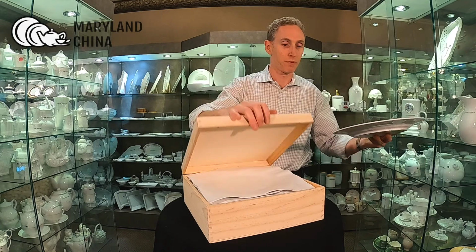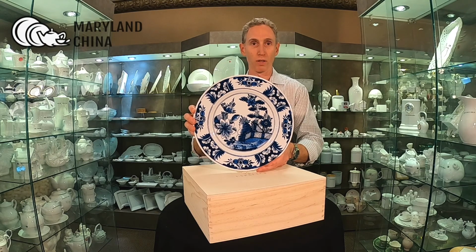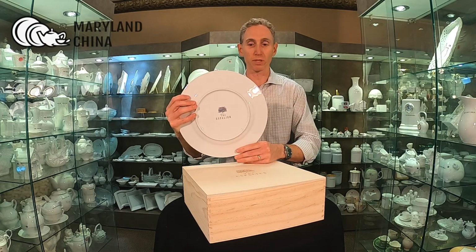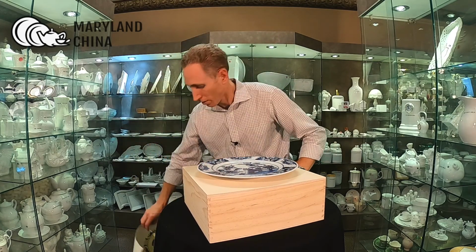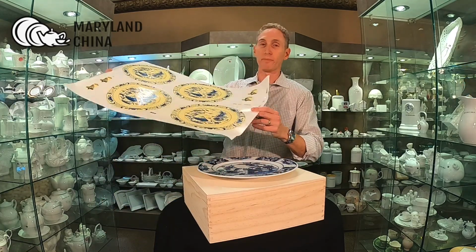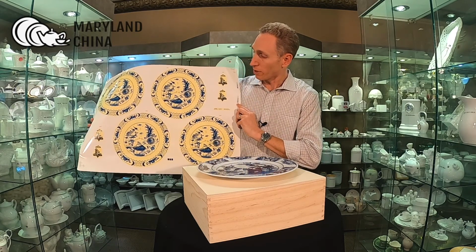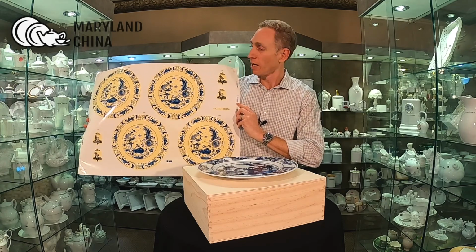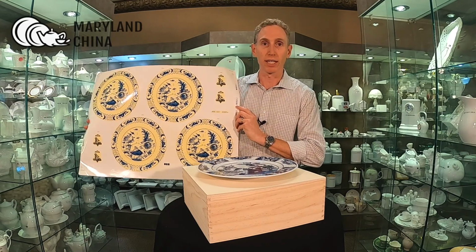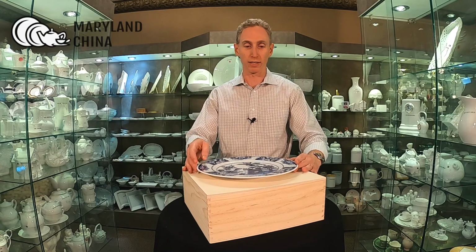You can see here, the plates are porcelain rim plates that we then print on the front, and the back has their logo and bottom stamp. And again, how we printed that, I'll show you the decal sheet here. We sent them the exact sizes, and then they laid out the forms and the artwork they wanted to put onto this large sheet. It took 2 different layouts to get the 8 different designs, but then we let the factory handle printing these decals and then applying them and firing them. And then we brought in the items, did a little repackaging here in order to get the finished product.